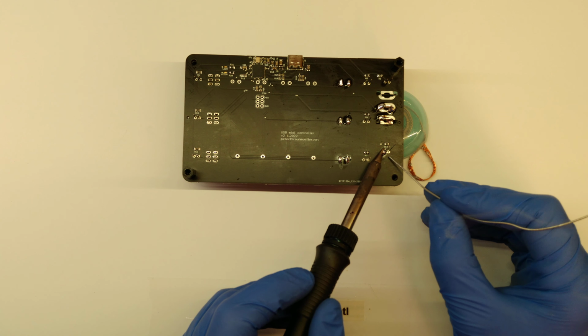Those solder joints on the back are for the sliders, so they have 2 joints on the top and 1 on the bottom, which means that you cannot put them in the wrong way around. Just if you were wondering, the switches you can put in both ways around. It doesn't actually matter. Whatever way they fall in your hand, they are symmetrical in their electrical connections.